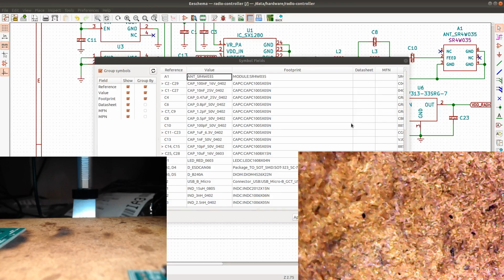Yeah. So that one is in place. And I'm not actually looking at the microscope when I do this. It'll be a little bit annoying to do that. I can see the positioning just by looking at it so closely here. But then I can double check that they're properly aligned by looking in the microscope. We'll heat them up later a little bit more when we solder all the components that are around these capacitors. So that one was done.